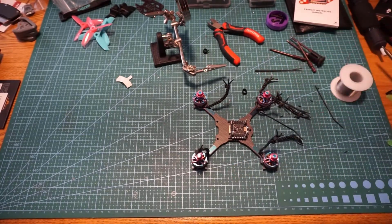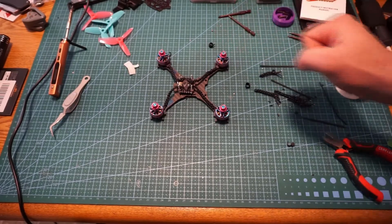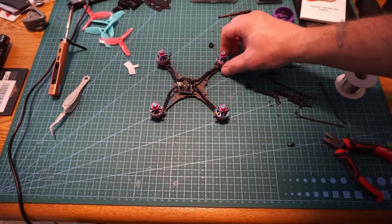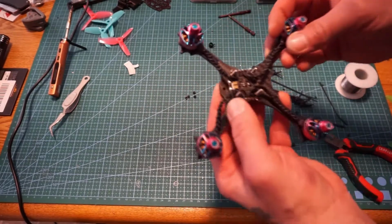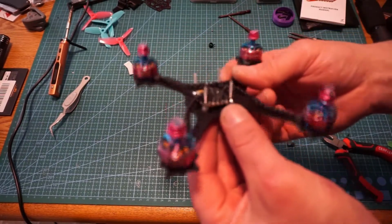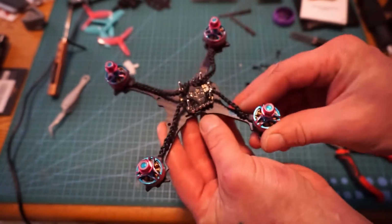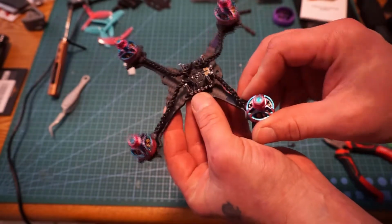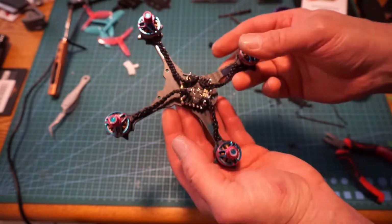Now it is ready to get soldered on to the ESC. So you got everything soldered up. I didn't feel like doing a video on the soldering or a time lapse or anything like that because it's kind of tedious getting in all those tiny little places. It's not the greatest job, but it'll work. It's good enough. They're nice, they're shiny, they're clean, there's no cracks, they're not frosty, they're not discolored.